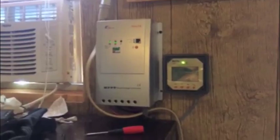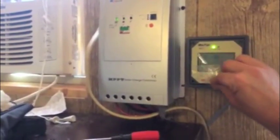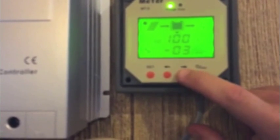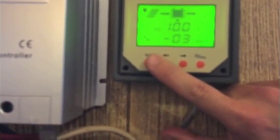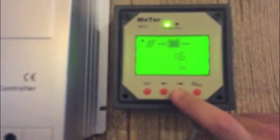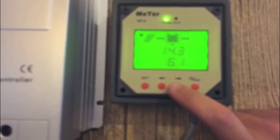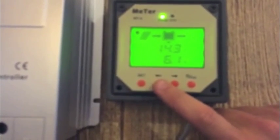I had to switch from the GoPro to my iPhone because I ran out of juice. You can see I've got the new MPPT charge controller up. I'll take the plastic off — yes, I am Italian, we like to leave our plastic on things forever. It lights up nicely: it tells me the charge of the batteries. I need to look at the instructions for some of it. It shows amp hours, what's going to load — currently nothing — 19.1 volts coming in, 14.3 volts at the battery, with 6.1 amps.